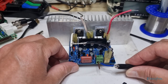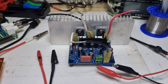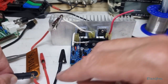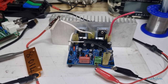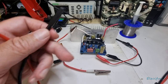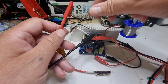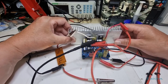Okay, so that's ready to go. We're going to get it connected up to the inputs. This is our main input going from the wave generator. Then we've got power and the 8-ohm output. We've got a ground that does for everything, and then the audio output. I'm going to use the power supply — red and black for ground, and red and black the other way for VCC plus. I'll do a quick check just to make sure — yes, that's VCC plus.